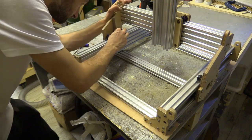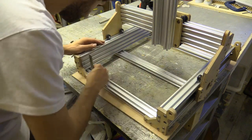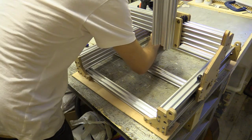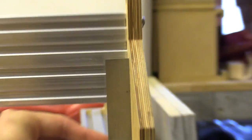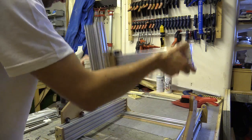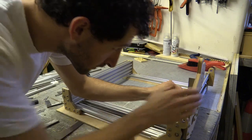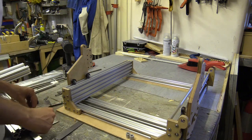I used the bevel box to level the blade on the table saw, but my fence may have warped over time. I could just live with this and level the spindle to the wasteboard when the time comes, or I could flip the C-beam upside down and see if that changes anything. They're still at an angle, so I'm going to take the bottom ones off as well.